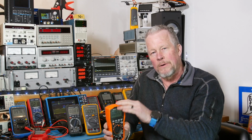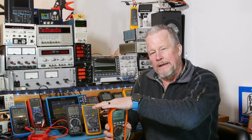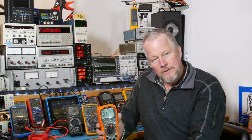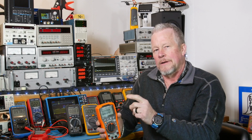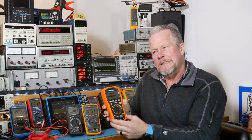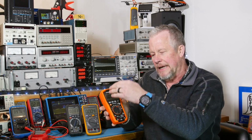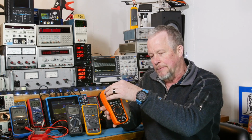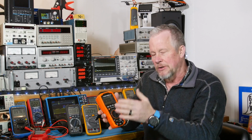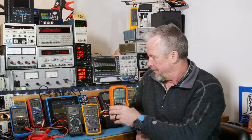A one, a rating of one means if it's raining and it's landing on top of it, it can run over the top and go vertically down. A two means it's rated for about a 15 or 17 degree angle, so you can have a little bit of water actually hitting the top and running down, so it might have a better chance of sinking in, right? The next rating above that is sprayed water. So that's your IP rating.